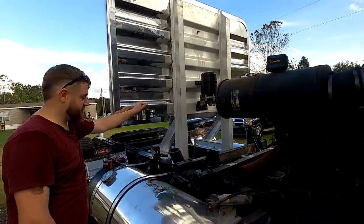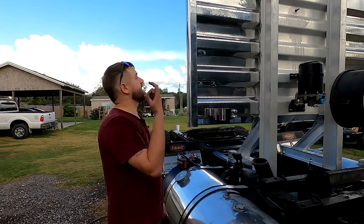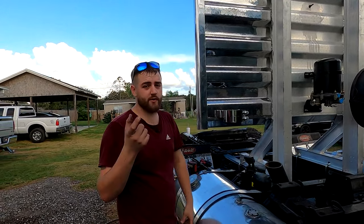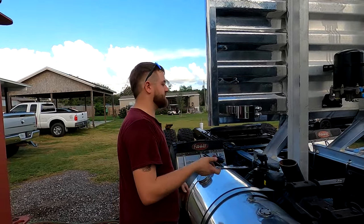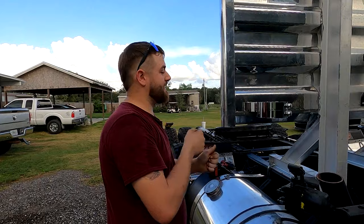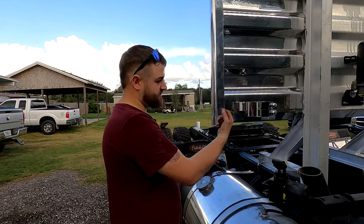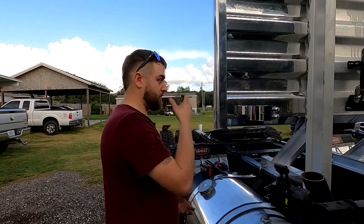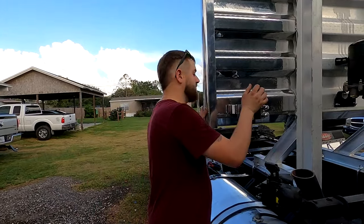Well, with much frustration and having to cut bolts off because of the stainless hardware that we got from the hardware store, yes, I know you can't impact it. I found that out right there. I forgot, it's been a while since I've done any stainless. I tightened these down by hand nice and slow, and they just bound up. We had to torch them off. So I found some shorter stainless bolts that are the correct ones that work right. I guess Ace Hardware had the wrong cut on these bolts or what, but it's there.